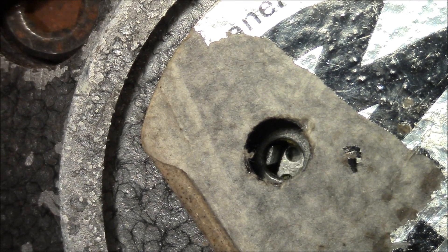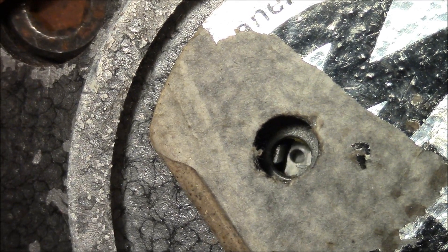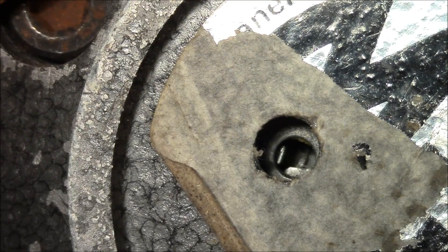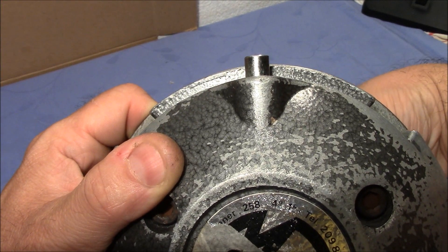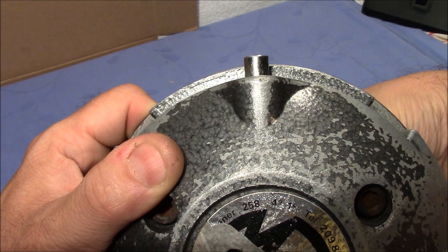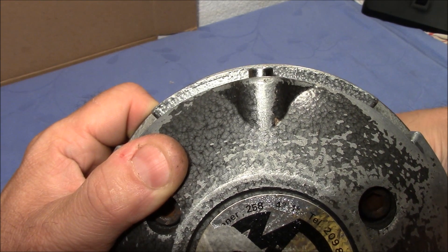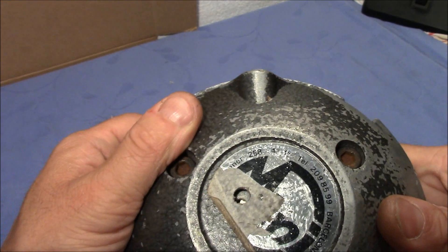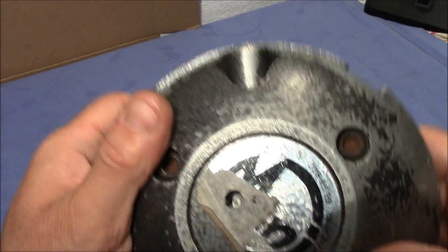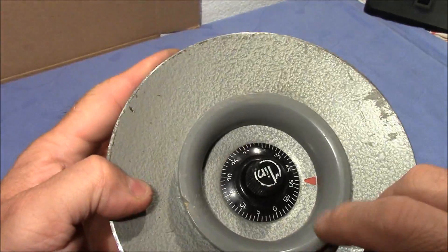Here's the gate - the second gate. Turning clockwise again, the third wheel starts turning - here's the gate. Now when I turn it in the counterclockwise direction, it gives a click and the bolt can be retracted by turning again in the clockwise direction. That's how you decode the lock when you have access to this little hole.